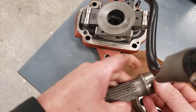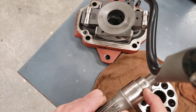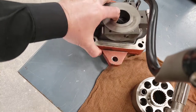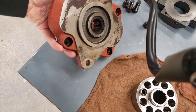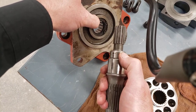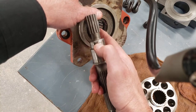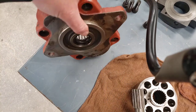The other place in the pump that can be an indicator of dirty oil is where the lip seal rides on the shaft of the pump. Here we've got some polishing, which is pretty typical. If you've got deep grooves worn in there where the seal lips ride, I probably don't have to tell you that the soft lips of a static seal can't cut into a hardened steel pump shaft. But what can wear grooves in a hardened steel pump shaft is abrasives. So if there's dirt in the oil, and specifically sand around this area, then that can be an indication that the maintenance on the lubrication system hasn't been very good at all.